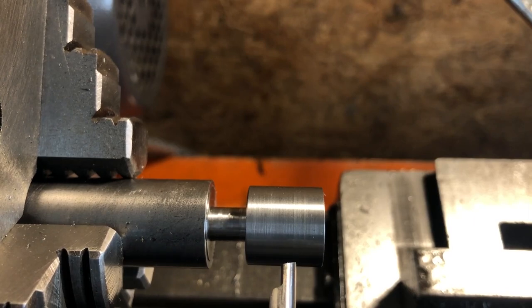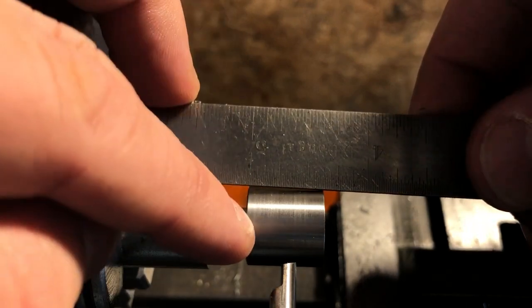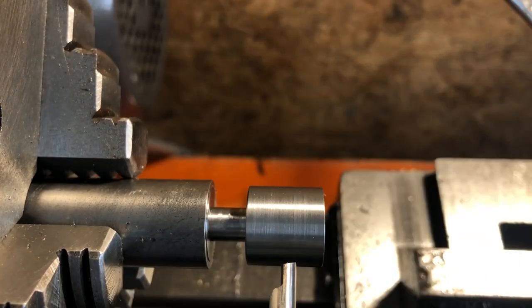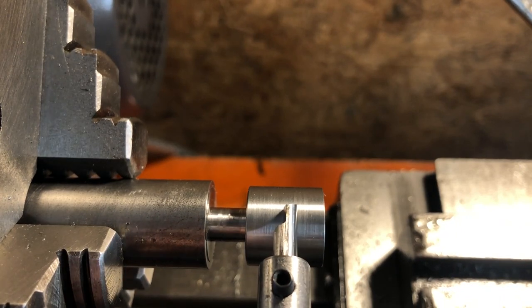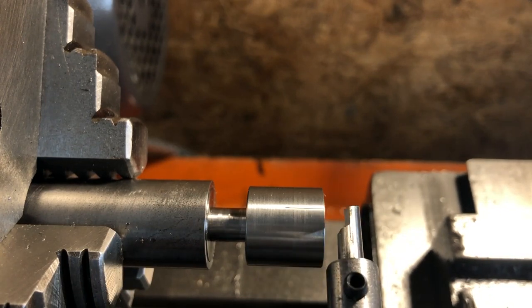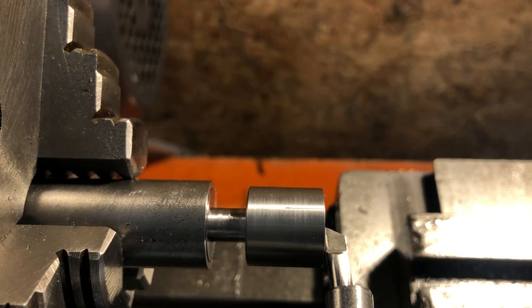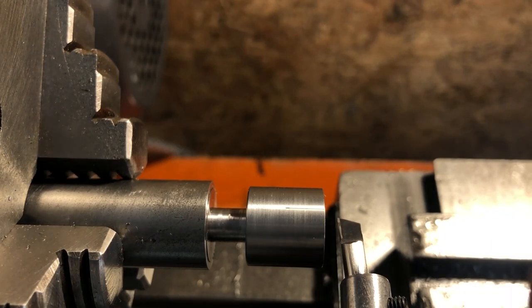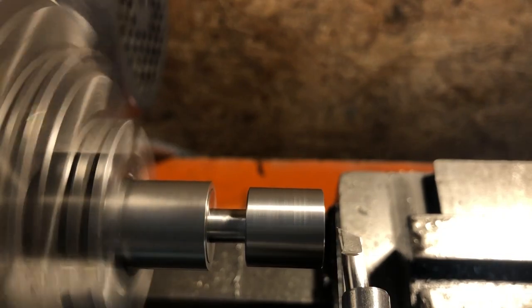I need to extend the work to give me a good inch of clearance between the relief groove and the chuck, to give the tool space to rotate. The carriage needs to be set to position, which is done by bringing the tool onto the work from above, and then without adjusting any settings, the carriage is moved to bring the tool up to the end of the work. The carriage can then be locked and the tool completely backed off so that it clears the corners of the work. After that, we are now eventually ready to make some cuts.